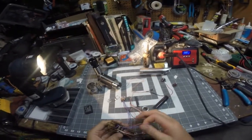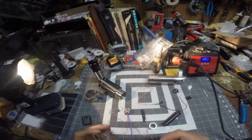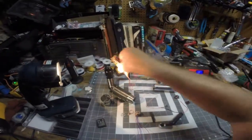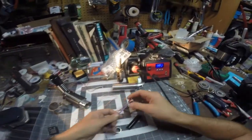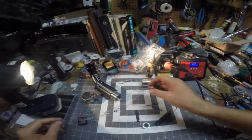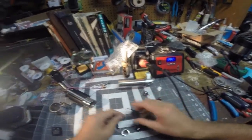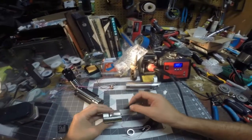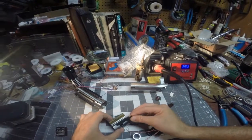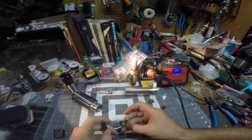So look at that mess of wires coming out of there. These wires here are for the RGB chamber LED, and this is all for the recharge port. And then coming down from the saber, I'll have my main LED wires, 2 blue, 1 purple for flash on clash, 1 red common positive, and then I'll have my 2 switch wires. Now on this saber, I didn't say earlier, but I'm using a clamp card switch, so it'll be inside the clamp, and the switch actually sets in the clamp card switch.